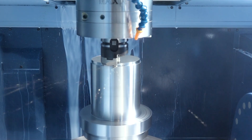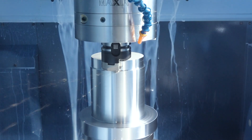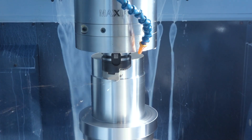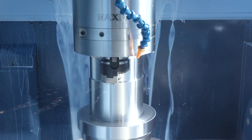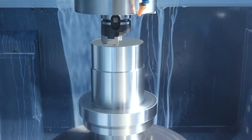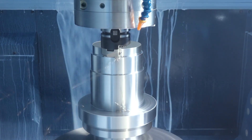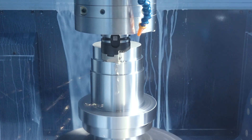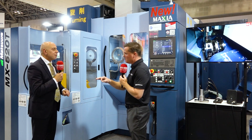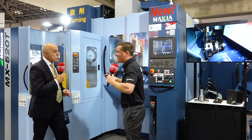That makes it difficult on a normal multitasking machine to automate, especially if you're doing variety. This is where we win. If you're making the same component every day, it's easy to put a cobot, a robot, or a gantry. But what if you want to make one of them, one of them, one of them? It's completely different. We move the pallet with the work holding for all those different variety of components, and with a big tool magazine, we make the part in one hit. We've now added turning to that same milling solution — high mix, low volume.